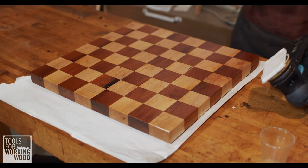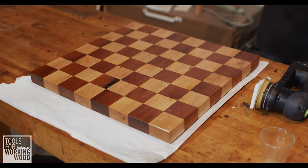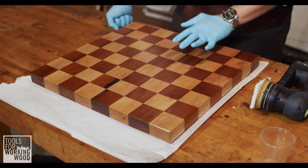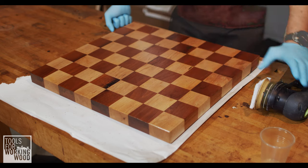All right, that's pretty good. The surface doesn't look terribly glossy — looks like we buffed in a lot of that finish, not too wet on top, which is kind of what we're looking for. We're going to get this tacked up, give it about five to ten minutes, and then I'll quickly come back and really buff this finish in with a fresh white pad.